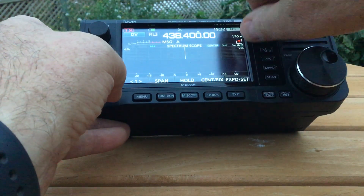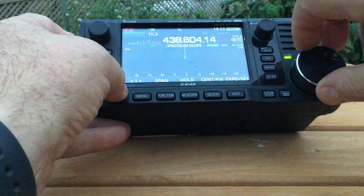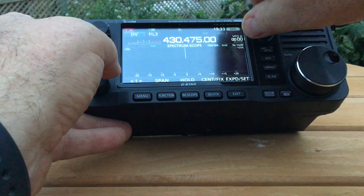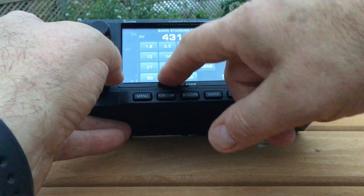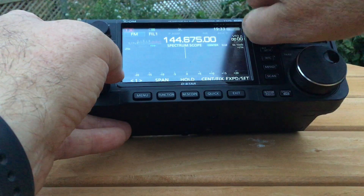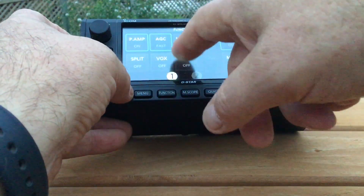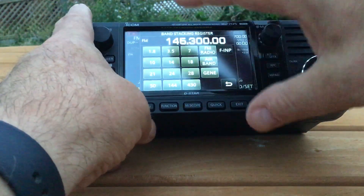If I tune through the band, I love some of these things we see. It's auto-scanning between FM and DV until it sees a signal. I don't know what that is — it's just a bit of local interference, probably something in the garden. Nothing on the band. Let's have a quick listen on 2m to see if there's anybody on there. 145 MHz — there's a net usually on there, but they're never on when you want them. You can turn the preamp on and off on all bands — HF, 6m, 2m, 70cm.